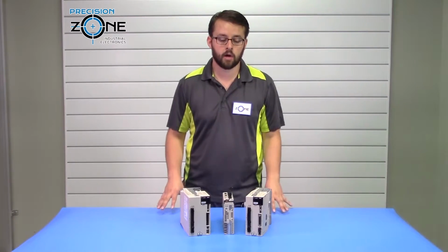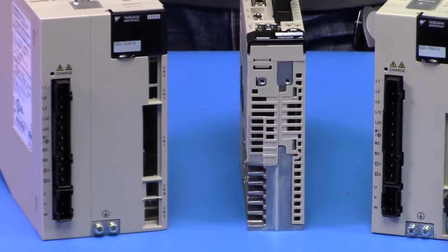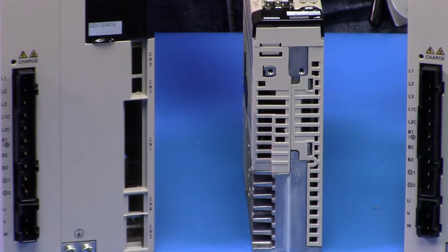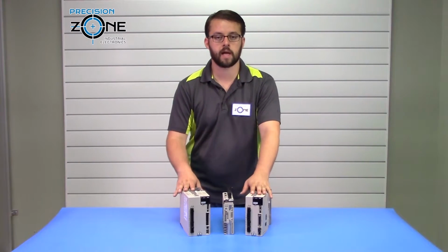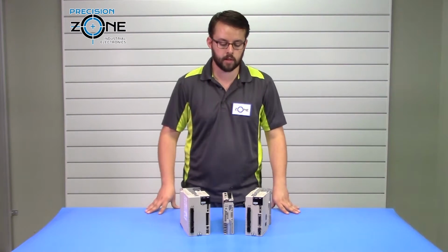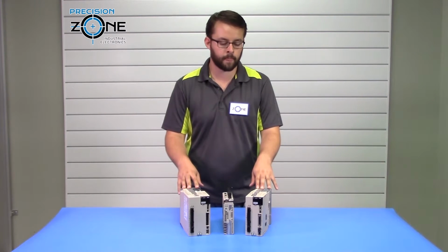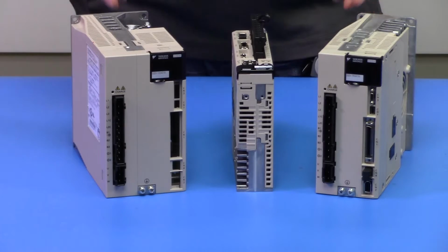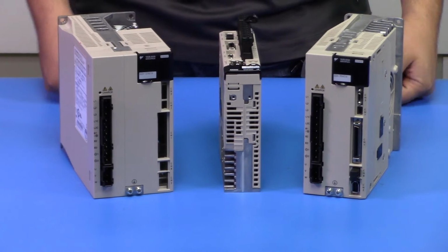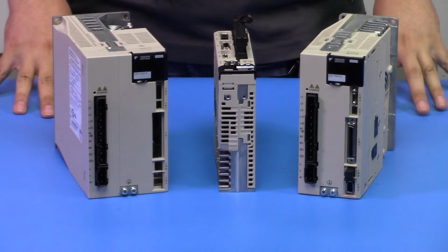Moving on to encoder related alarms, you're going to be getting alarms mostly in the 800s and Cs. For all encoder related alarms, there's a few things you want to check. You want to make sure that the connection between the motor and the drive is set up properly. You want to also verify that the connection between the drive and the encoder is set up properly. This can also be caused by a faulty encoder or a disconnect between those two, a loss of communication. You want to verify that your encoder parameter settings are set up properly. If those haven't been set up properly, set those correctly. Test the drive again. You also want to check that the encoder setup procedure has been done properly, as those could cause any of those alarms.